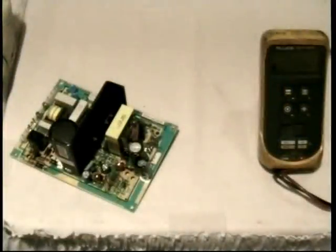But that's the little loop I showed you, or at least I tried to show you earlier, but now I can because the light's better. That's just this. See this wire that's just wrapped around the core? It's 1/2 of a turn, isn't it? This is a transformer secondary. It's wound around the core of the flyback transformer, which is this thing. It's a secondary winding made of 1/2 of a turn. It'll pick up a fraction of a volt. That might even be close to a volt, actually. And then that goes to this connector right here, which you can see is right in the power supply. That's the connector that says flyback transformer locking.